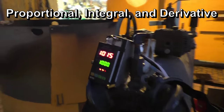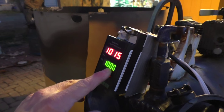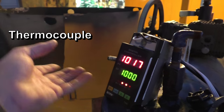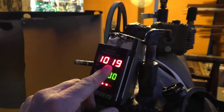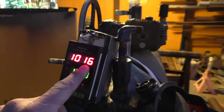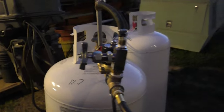These things are magic to me, but with a PID you know we set the temperature we wanted — a thousand degrees. It has a K-type thermocouple, a pyrometer. It's a temperature sensor, and this is the actual temperature it's at. When it gets too high it stops adding additional gas, and when it gets low it starts actuating that valve and adds a little more gas.